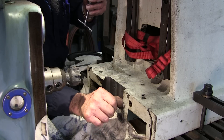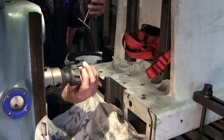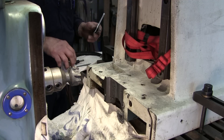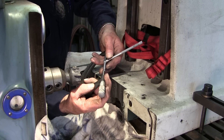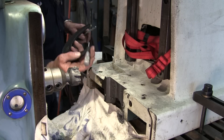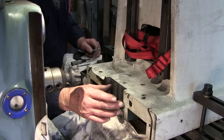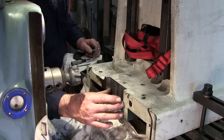There is a slight bit — I mean I went to zero each time — but there's a little bit of raise on the insert there, so the very tip actually has a proud cutting edge compared to the rest. So we got four inches eight there; we had four inches nine, so we're going to go ahead and start fitting our block at four inches nine and check it to see how it feels inside here.